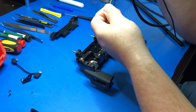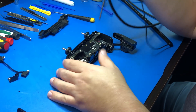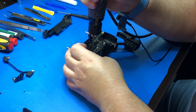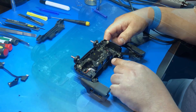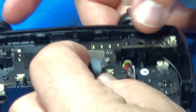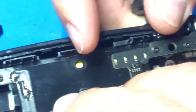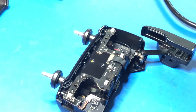We recommend using a hand screwdriver — we have this torqued specifically for this. Now it's time to reinstall the keyboard flat cable. That just pushes down on top of the header, and then it's secured with the metal plate that you saw earlier.